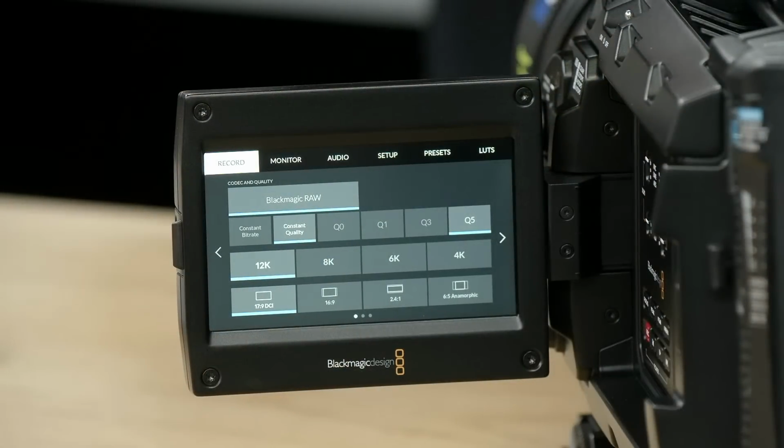So you can see there, it's a native Super 35 12K camera, but it's also a Super 35 8K camera, and it's a Super 35 4K camera. So at those resolutions, you're getting the full sensor and it's not cropped. You don't have to crop to get that. And there's no binning problems, you don't get any aliasing issues. The scaling's actually in the sensor. And because it's in the sensor, it actually reduces the data rate coming off the sensor as well. So the frame rates go up.